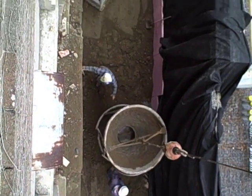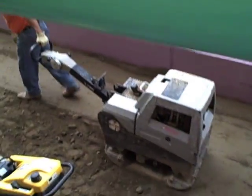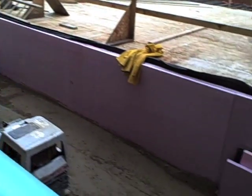In either case, the soil must be carefully compacted so that it doesn't settle too much later. It's all got to be compacted per the specification. Some of this backfilling must wait until the first floor concrete slabs are in place, so that they can brace the foundation walls against the lateral stress of the soil.